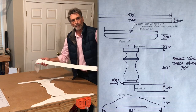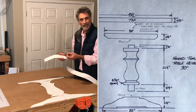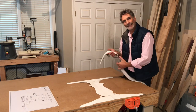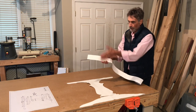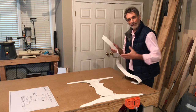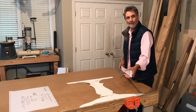One of the final pieces that was really important to us was the tabletop itself — we wanted something really heavy. A lot of tables you see have that three quarter inch top, whether it's walnut, cherry, or whatever, then indented about six inches with a three and a half inch piece of wood surrounding the perimeter. What we're going to do is take the three quarter inch finished tabletop and lay on its side another piece of poplar, one and three quarters inches, going downward about three inches. That'll give it a real heavy feel. So let's get cutting and proceed from here.